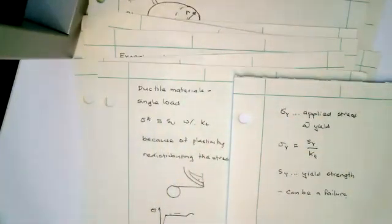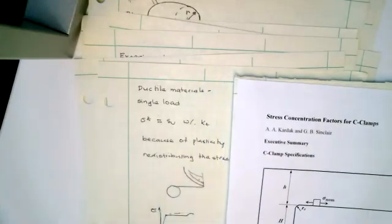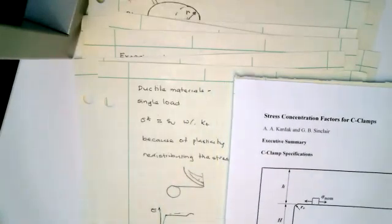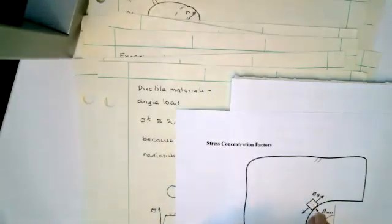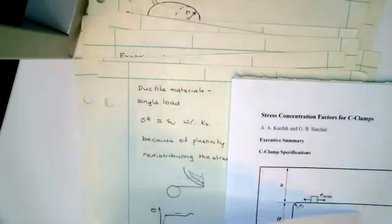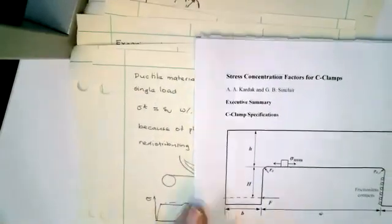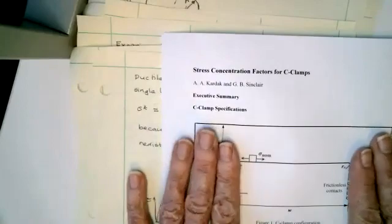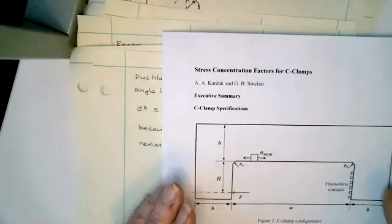So what's going to happen then? This state here has one stress, sigma theta. That's the only stress there. There's no sigma r, okay? On this side, no shear stress. This is like a little uniaxial tension specimen, okay? And it'll start to yield, and if this yields, this device is no longer any good. The legs go out like this. It doesn't hold the pipe that's coming apart in here, and the thing blows all over the place and shuts the plant down.